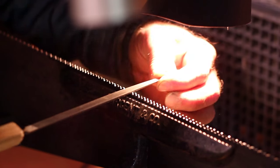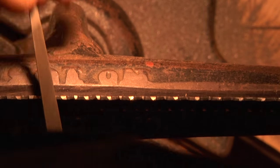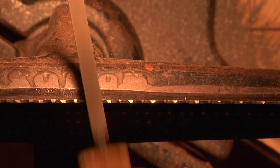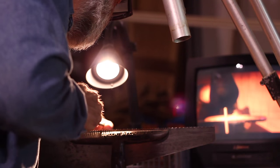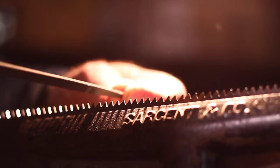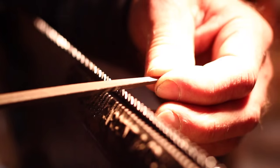When I'm trying to gain even spacing and get back to nice even spacing, I really don't have anything to look at except the flat spots on the top and the depths of the cut between the teeth. So it's all done visually. I don't count the number of strokes on each tooth — I have no idea how many times I've been in any area. I just do it by visual, making very immediate decisions as I file about which tooth to drop the file into and whether I should be filing in this direction or that direction.